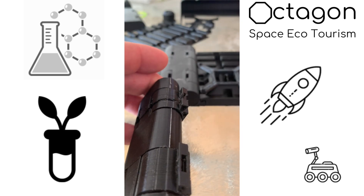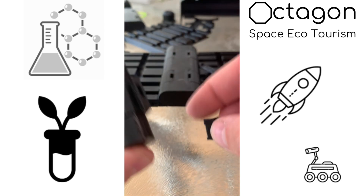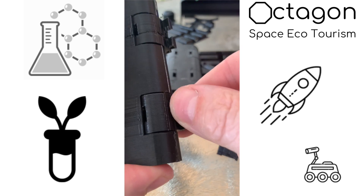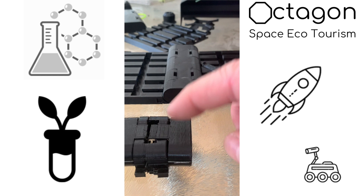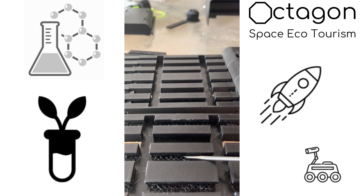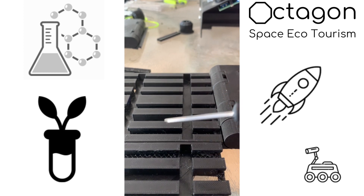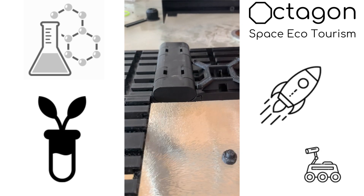On this side you can really see this line — these pieces were printed at 90 degrees and fused right along that line. The second attempt was printed standing up with bigger T-slots. It actually does work when inserted, but the end pieces just fall out all the time. Another scrapyard tour, more things to scrap. Some of the little feet broke off — one was printed with tree support versus normal support, which introduces so much friction that I actually broke some feet off.